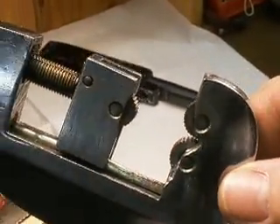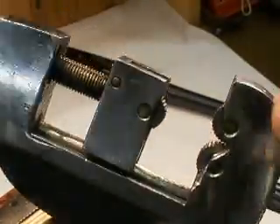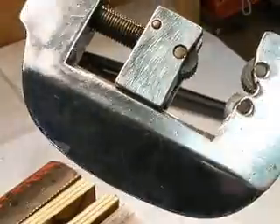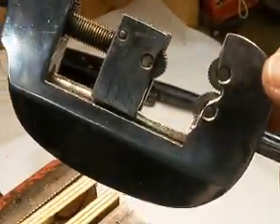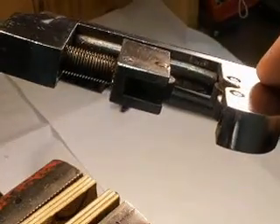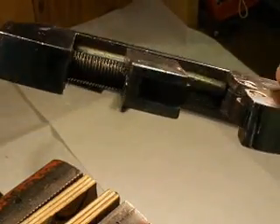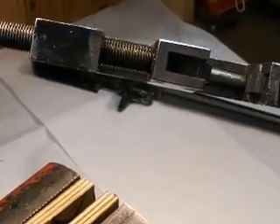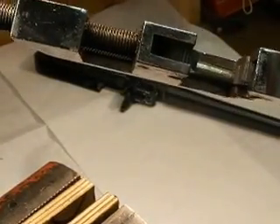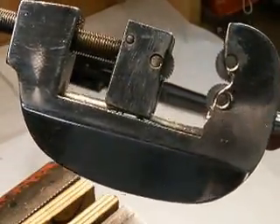Thanks for watching the video. If you have a hand knurling tool of your own, preferably an American-made one of a little better quality — this one from ENCO is pretty cheap, but it worked okay. If you have a metal lathe, you can also do it in a lathe: just hold the barrel in a four-jaw chuck and center it, or maybe between centers, and do a real light knurling. Thanks very much for watching.